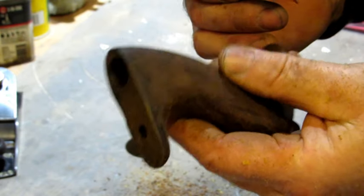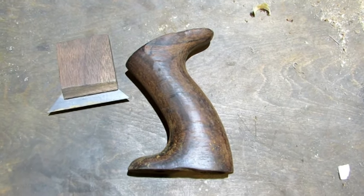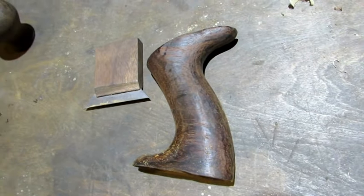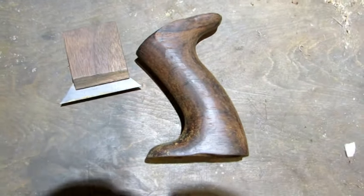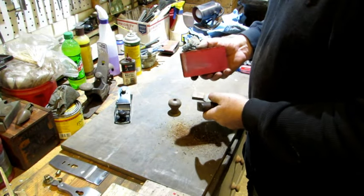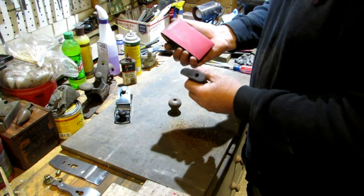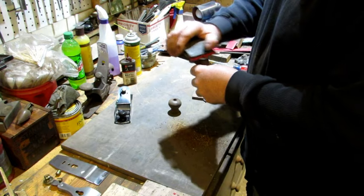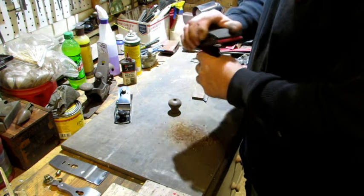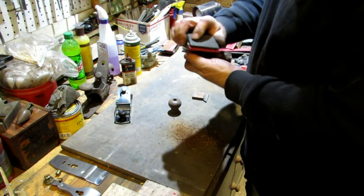You can't see it. I've learned from experience that sanding won't work on its own — it'll work for final finish, but what it won't do is get two uneven surfaces perfectly even where you can't see where they went together. The best way to do that is scraping; you can control the amount of rosewood you're removing a whole lot better. The next step is to sand the tote. I like to use the old rubber sanding blocks — they're more for auto body work, but it's just what I've always done. The sanding is pretty straightforward; you do it with the grain. I start with 150 grit paper and then move on to the foam sanding block.